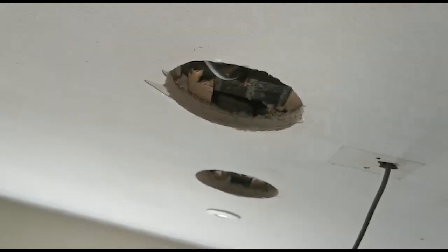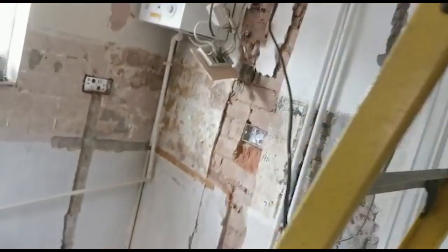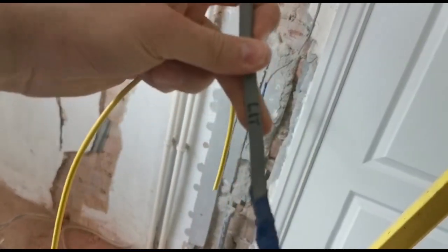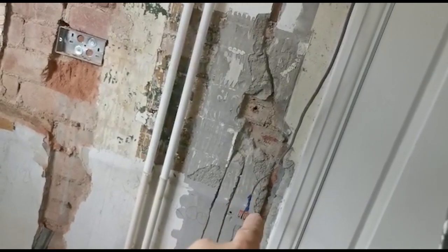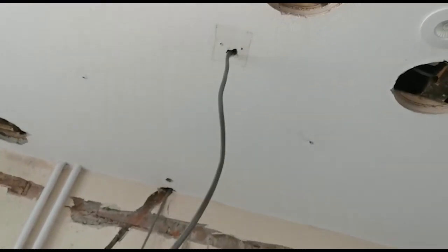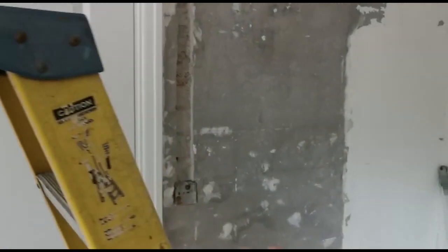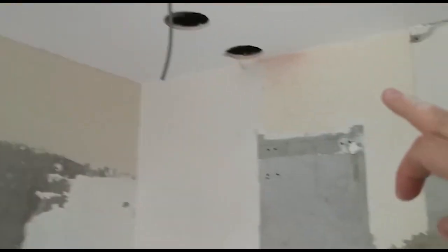So that's how we wire our lights — Aidan's basically wired between every light, going from light to light using the access holes to get the cables through. Then from the last light, which is this one with the single cable on it, we go down to the switch. We're going to pick up a neutral from here — you've got switch live and neutral there — and extend it down to the switch. Then we're going to knit the permanent live through a little connection up there and bring that down into the switch as well. These two cables would normally go back to a joint box, but we can't access it because there's a bathroom above and the living room on the other side. So we'll get them both down to the switch, feed the cable out to the downlights and send the cable from there to your under-cabs as well.